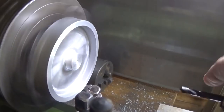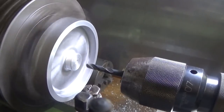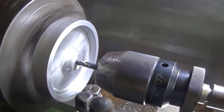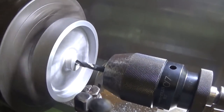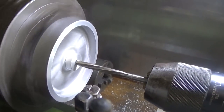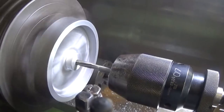I've got a quarter-inch reamer, which is a bit of a luxury really — but they're not that expensive on eBay. You will find one, and it's probably something you'll use again and again if you're building anything at all, so it's worth getting one. But if you haven't got one, use an undersized drill — if you've got a selection of drills, work up in tiny increments and you'll get a much more accurate hole. Finish it with a nice new drill and you'll get it somewhere near where it needs to be. I'm using the quarter-inch hand reamer in the drill chuck, which is probably a bit naughty, but it gets everything nicely lined up.